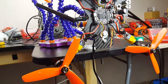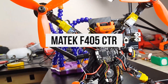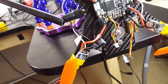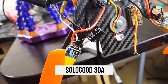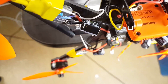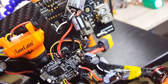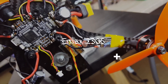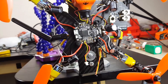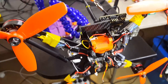For the setup, we're going to be using the Matec F405, keeping it consistent. There is no voltage regulator for the VTX, giving us a clear visual representation of what's going on in the FPV video feed. For ESCs we're using the Solo Good 30 amp ESCs — the noisiest I've seen so far, generating the most noise of any setup in my shop. For motors we're using the Emax 2306, a 2400 kV — very harsh on ESCs and very noisy, but strong and durable motors.